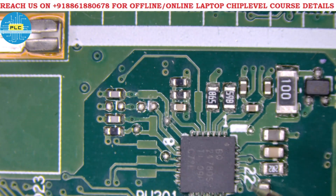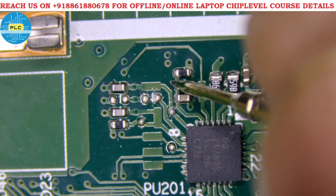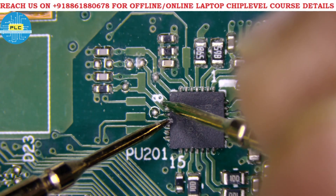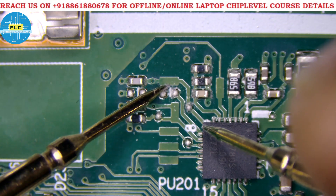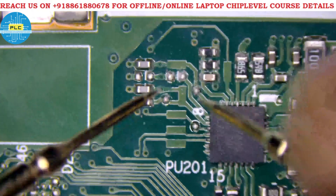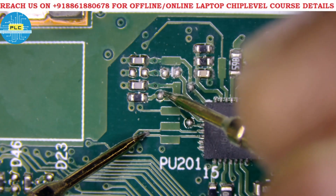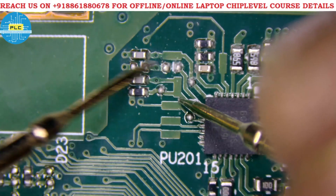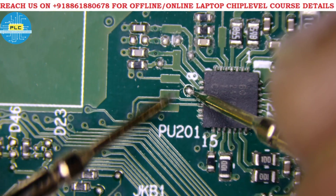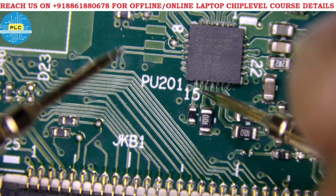The AC detect voltage divider point is connected through a jumper — zero ohm resistor — and then a capacitor is given. Pin eight is high charge — it is open in the schematic, which means discharge condition. Next, connections include a capacitor and a resistor. Here is a testing point and a jumper. Through that jumper it connects here and here. One more testing point, zero ohm resistors — here, here, and here — and these two are not connected at all. Then the signal goes to some other path.